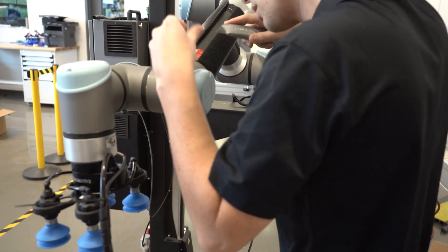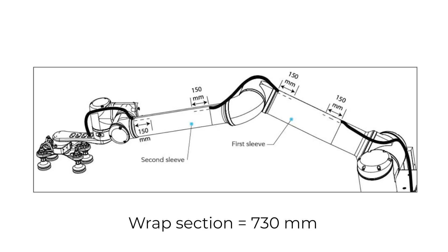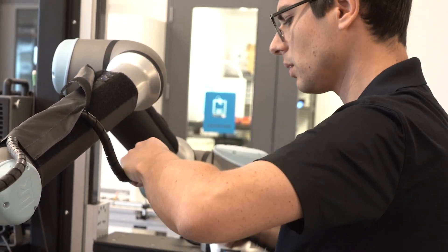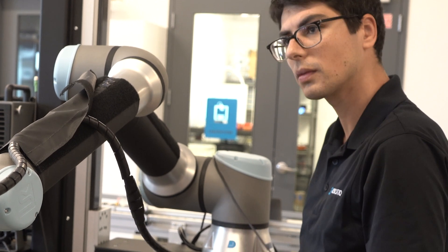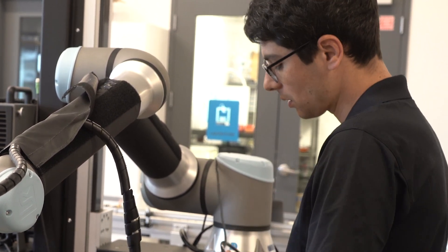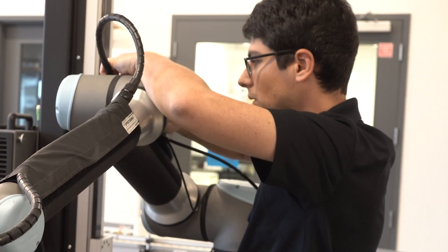Remove the remaining protective layer of the double-sided tape. Remove the hook-and-loop fastener completely on the second sleeve. At the robot's elbow, take the 730 mm spiral cable wrap. Position the spiral cable wrap so the first 150 mm can be inserted in the second sleeve and the last 150 mm can be inserted in the first sleeve. Insert the wires in the spiral cable wrap. Close the second hook-and-loop fastener completely on the end of the second sleeve and at the start of the first sleeve.